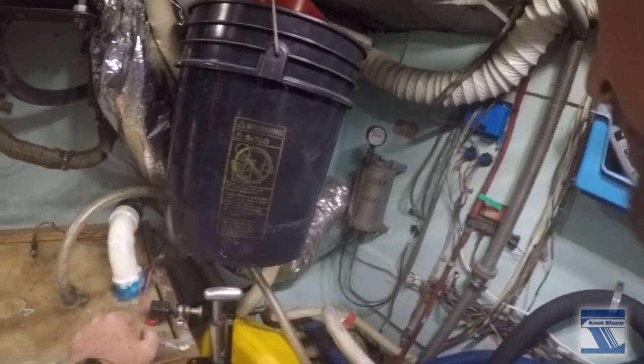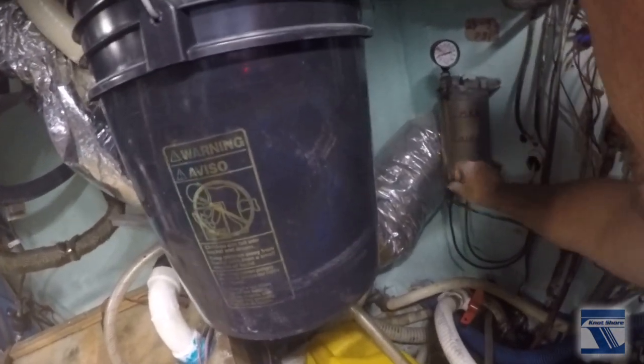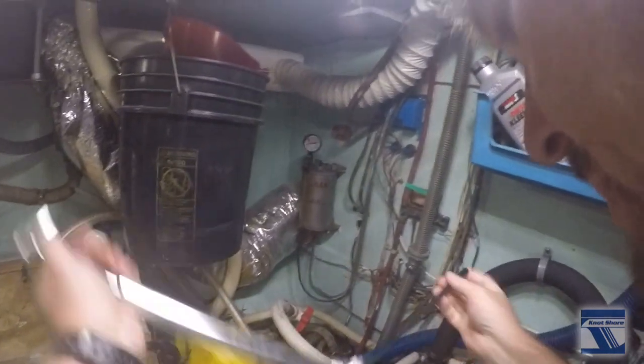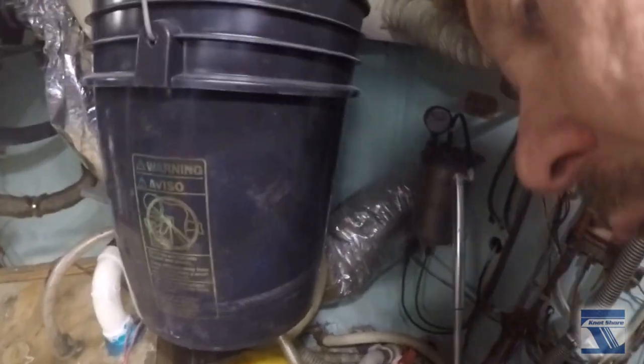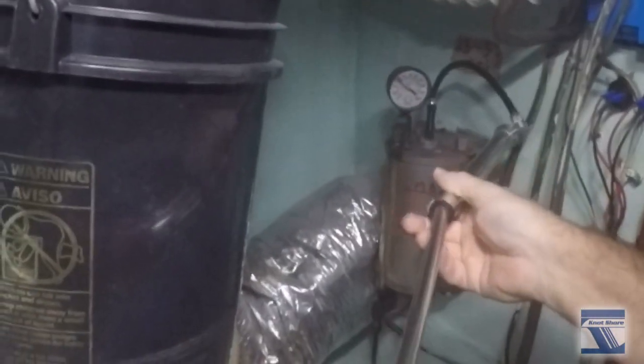Okay. So, to boost the, put the air back in the system. And right now, if you look at the fluid here, it says that it's at max. So the fluid's good. It's just getting air out of the system. So it's losing a little bit of air. So I have a bicycle tire pump onto a Schrader valve here, which is, again, just a bicycle valve. Let's get the camera right here. There, now you can see. It doesn't take much, so, like I said, I'm losing a little bit. Probably through a connection or two, I'll have to go back and tighten up a little bit because of the heating during the summer.